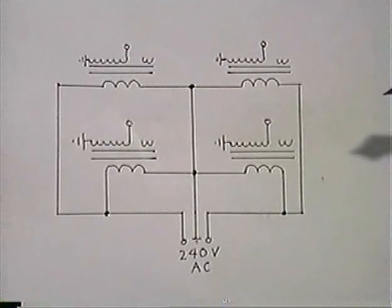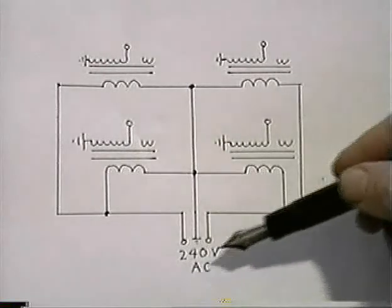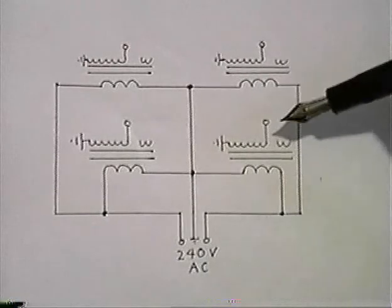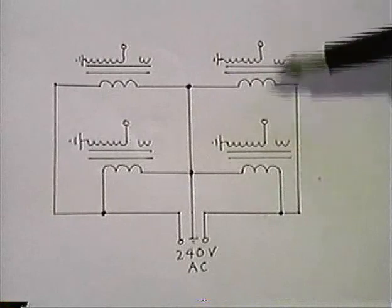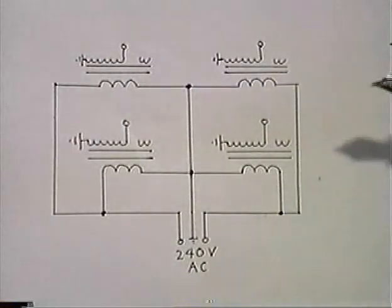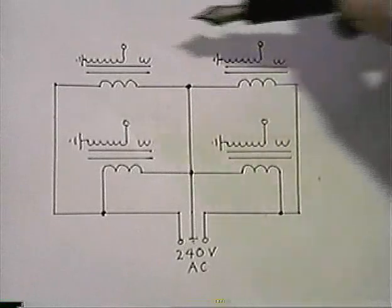Because the system is a half-wave system in the form of a half-wave voltage doubler, the transformers will all have to be properly phased so that all four magnetrons fire at the same half of the 60 cycles out of the 240 volt wall socket. When they are properly wired in phase, all four of these high voltage outputs will have little or no voltage between them.